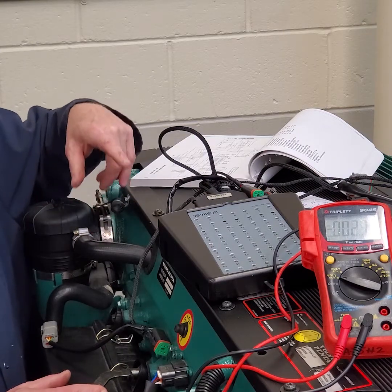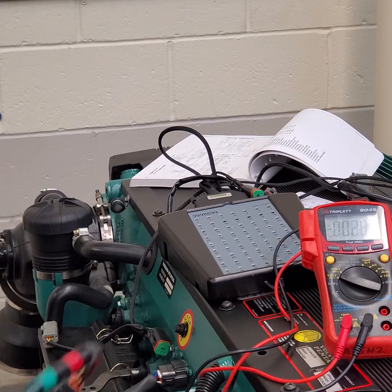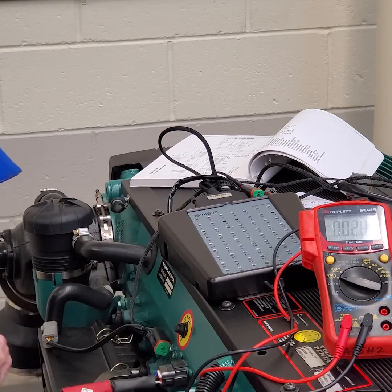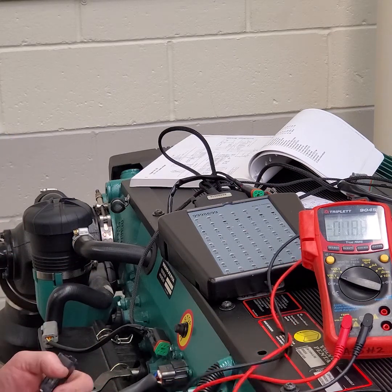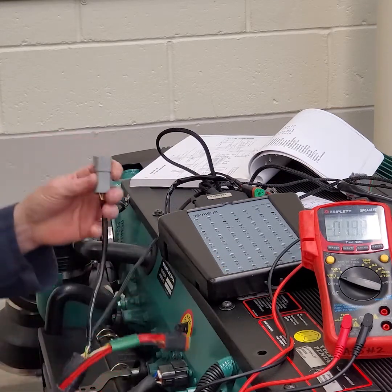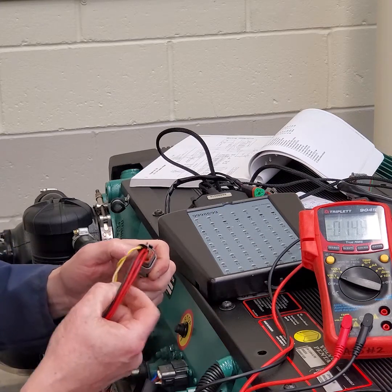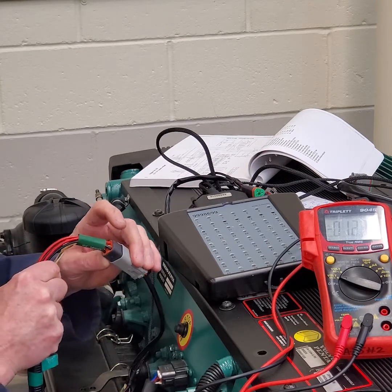What I want to know is: do I have communication getting to the Vodia tool? I have my extension harness plugged into my diagnostic connection that goes up to my Vodia tool. I'm going to use my breakout box. I'll disconnect my extension harness, take my breakout box, plug it into the extension harness 6-pin connector, and then plug my X2 data link into that. On my X2 data link harness I can see pins 5 and 2.